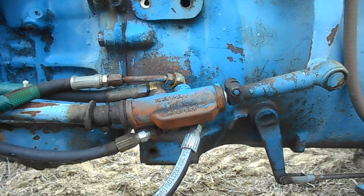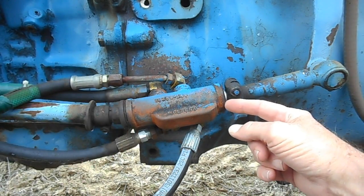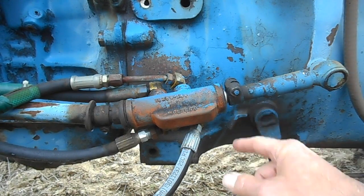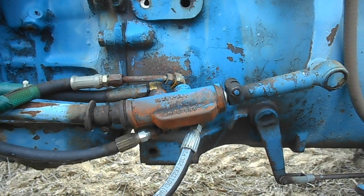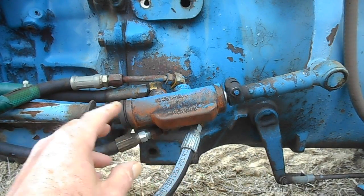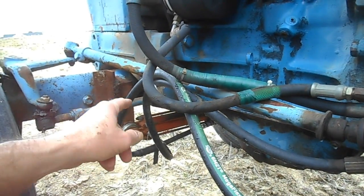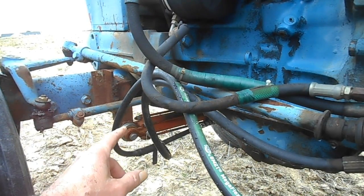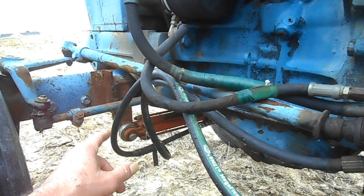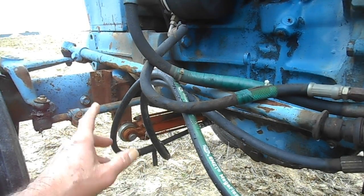Is it the part or the seals? It's the seal in here — looks like the seal right there, that's rubber. The leak is coming from right there. I've degreased it, cleaned it up, been watching it for a while. First time I noticed the leak was about a year and a half ago and tried to find the part then. What I found out was this is a European aftermarket kit. I guess it was about 12, 14 years ago, the cylinder that was mounted right up here on the front went to leaking and I couldn't find the right seals to rebuild it, so I bought the smallest cylinder I could find at Agrisupply and kind of redid it, dropped it down low, and made it work.